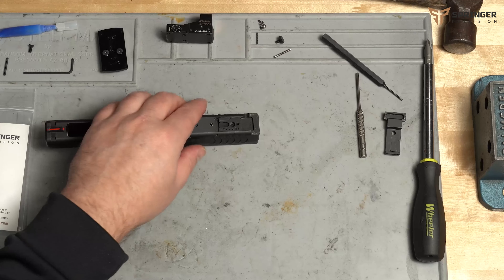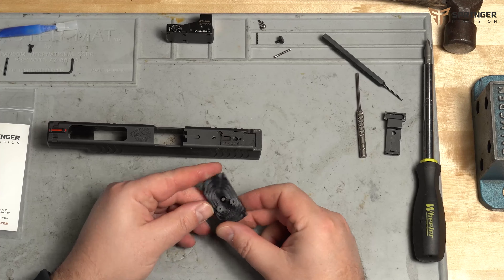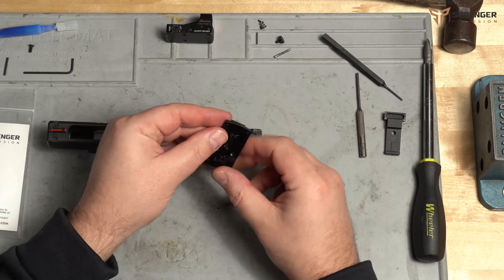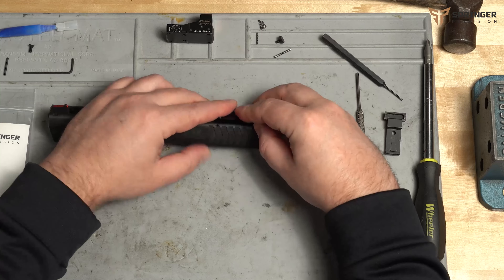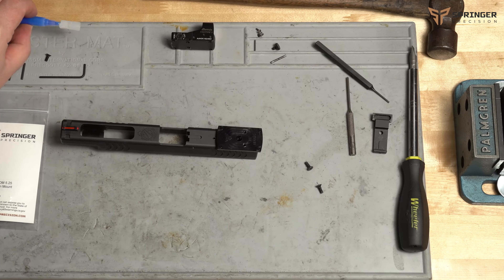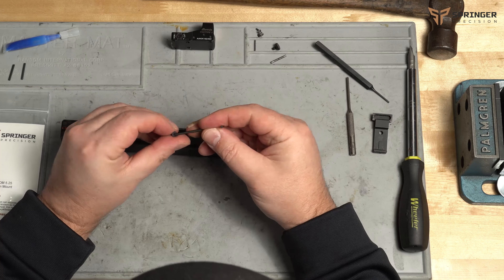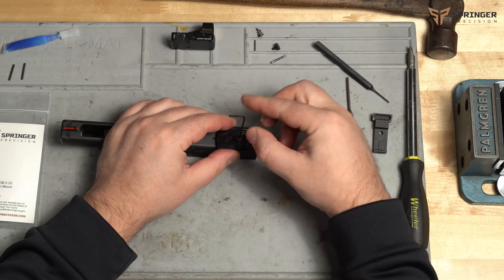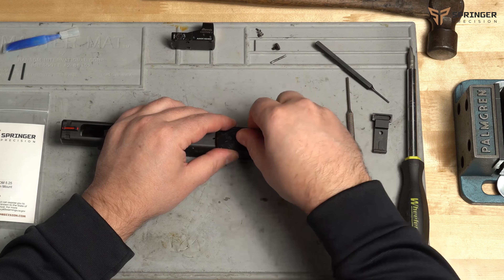I'm going to use some degreasing spray and then dry it out with my air gun. The next thing to do is to take your optic plate and remove the screws that are in it, and then we're just going to do a test fit. The little part goes in the front and snaps right in — it shouldn't have much play. We include a thread locker and recommend you use that; for these instructional purposes I'm going to skip that step. We're going to take the screw — this is a metric screw — and tighten it in until it's firm.